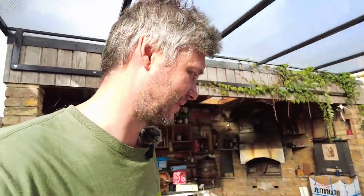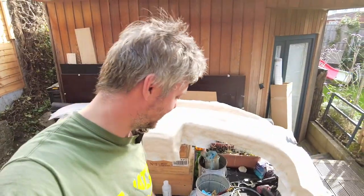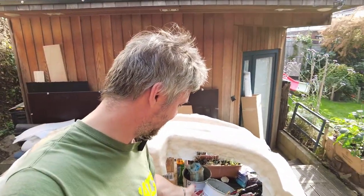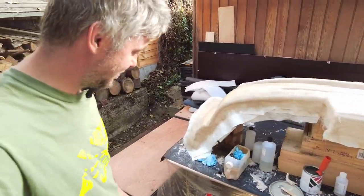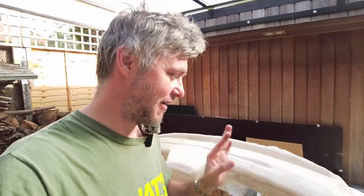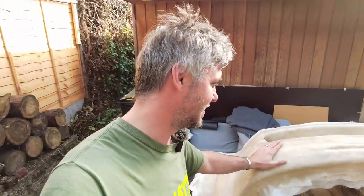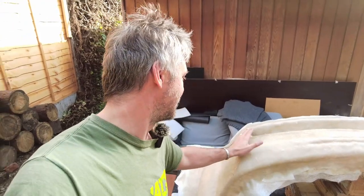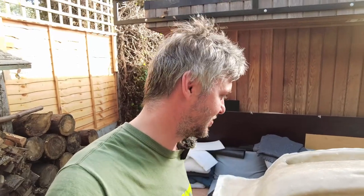Now finally, after about a week and a half, yes, it took me this long. A few reasons. I kept buying insufficient amounts of resin. So we basically used up two 5-kilo tubs of Unimold for the main resin, and then I used up the rest of my old one. So it's a bit of a mishmash. Most of it though is done how it's supposed to be. But in a few places, like here, for example, one of the last layers that I had to reinforce on top. Because remember, this is a mold, so it needs to be as thick as possible to retain its shape.